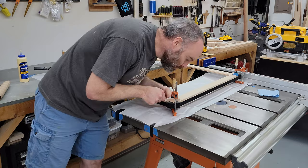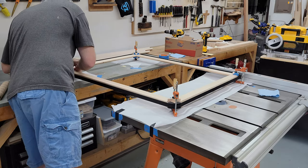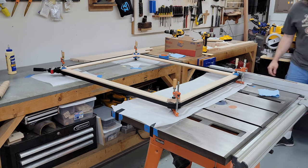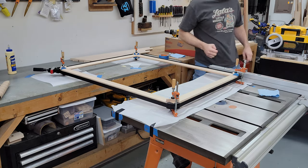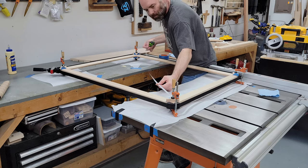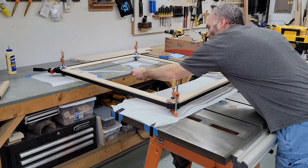After the frame was contained by the band clamp and I adjusted all of the corners so the boards met in the same 90 degree point, I clamped on my triangles to ensure the faces were aligned. After that, I measured the diagonals to make sure they were identical and double-checked that with a trustworthy square. It's kind of a small square, and a large framing square would have covered more surface area, but I've actually never seen a framing square that was close enough to perfection that I'd use it for woodworking.